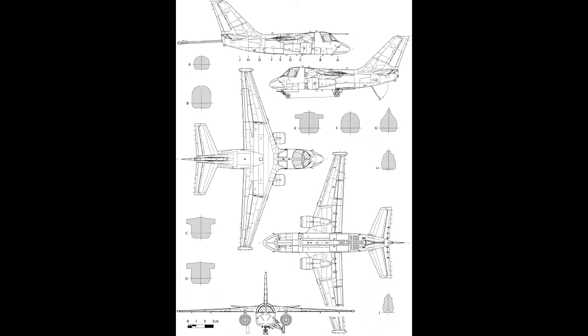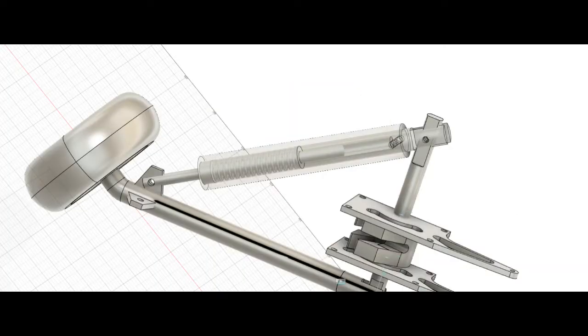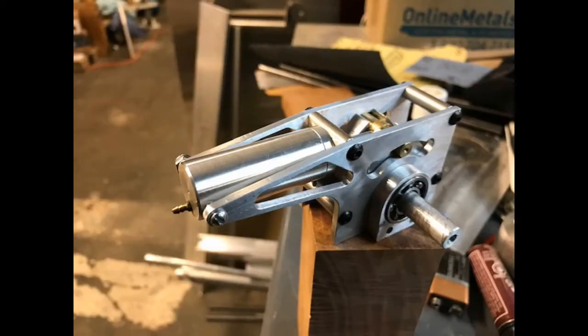We were able to borrow a set of A-7 gear of similar size to see how it was made. Unfortunately, it retracts forward, but the operating principles were similar to what we needed. At this scale, the S-3 gear is 18 inches wide when extended. When retracted, it and its 3.5-inch wheels had to fit in a very confined space. It needed to rotate a full 90 degrees and lock in both the up and the down position. We tried several different designs, but the actuator tended to interfere either with the gear strut or with the actuator on the opposite side of the airplane.